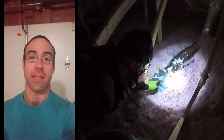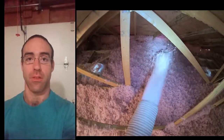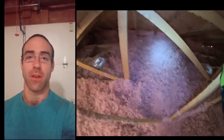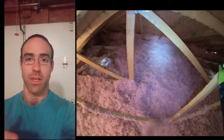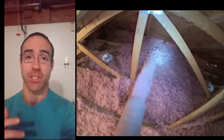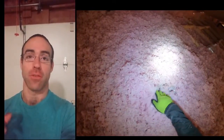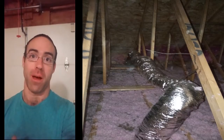You're also thinking that the trusses will only be covered by 4 inches, so that's always another area of heat loss I'll be talking about in another video. I also show an application of an R32 — that's 12 inches of loose fill — and still that only covers 2 inches above the actual cover of the bathroom fan or pot lights.